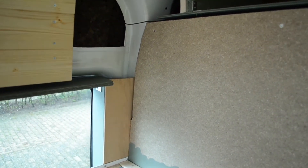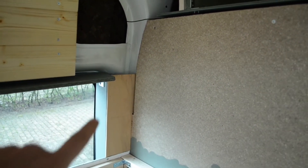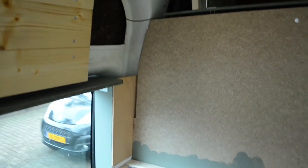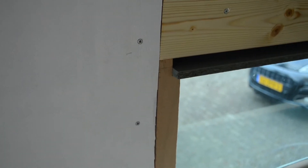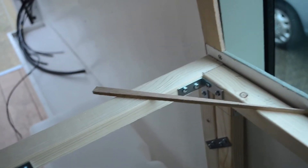We knew that the finishing touches here would be very difficult, but Yori started working on them. We have a small piece of wood here which perfectly matches the window frame, and we had to make that now instead of later because we still have to cut the cork tiles that will fit on here. That means we need the exact measurements, and it will also look much better afterwards. In this tiny gap we will have a small piece of wood, and all three pieces will have to be painted the same cement grey and then installed.